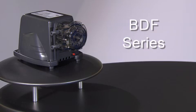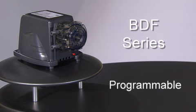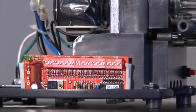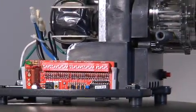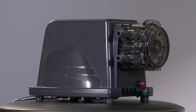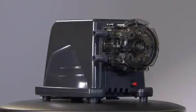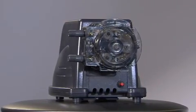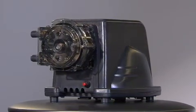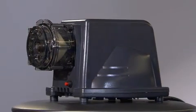The BDF Series is equipped with a low RPM motor and utilizes the same pump head as the Classic and SVP series. The pump can be programmed to provide the most efficient and effective dosing schedule and dosage amounts for treatment. Inside the motor housing, a programmable timer is activated by dip switches to provide a 24-hour or 7-day dosing schedule, up to 24 events a day and 21 ounces per event. The pump is often used to inject liquid enzymes that biodegrade suntan and body oils in commercial pools, or to inject liquid grease-eating bacteria to emulsify grease in commercial kitchens. The BDF can also inject biocides on a timed basis into water fountains and small cooling towers.